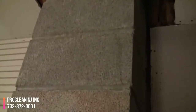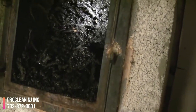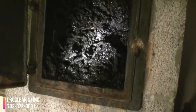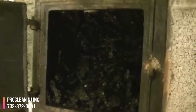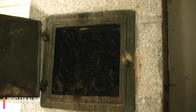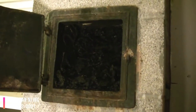The creosote was all the way down 12 feet until it got to this clean-out. I had to take 2x4s and screw them together to get all the way down here. There is about a 4-foot pile of creosote, so now I just got to suck it out with a shop vac, then run a brush up and down there to clean it out, and I'm going to want to inspect the chimney a little bit.